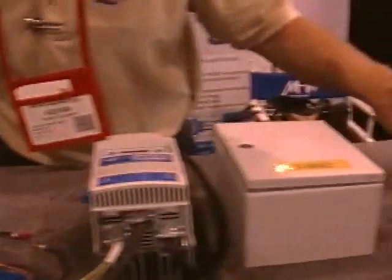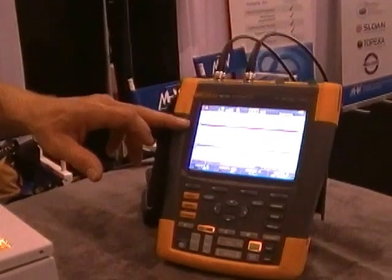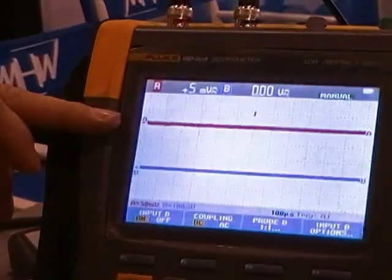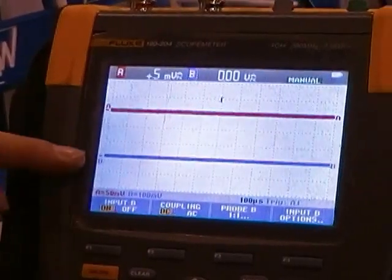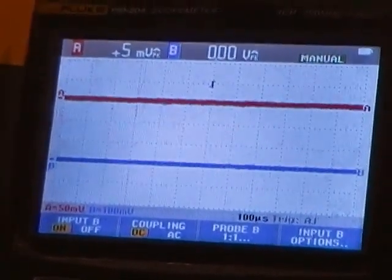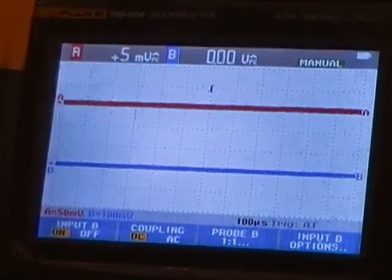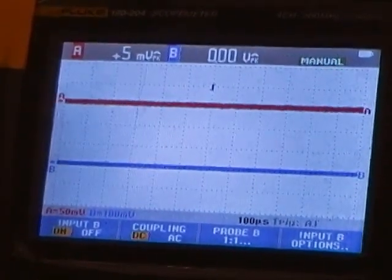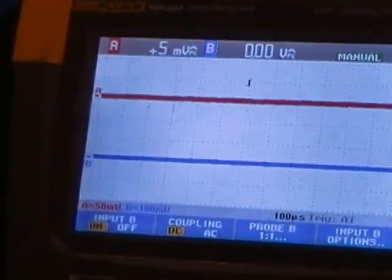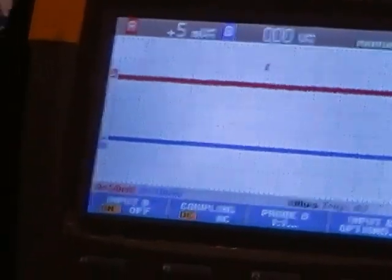As you can see on the screen, the red line represents the opposite drive bearing. The blue line is the common mode currents. This is on a static phase converter. We know we didn't used to have bearing problems with electric motors because our signal was clean. We are going to shut the phase converter off. I'm going to reconnect and actually hook to the frequency drive